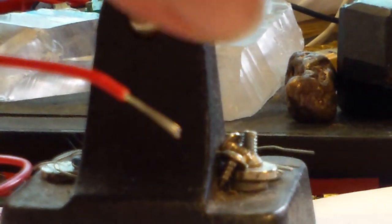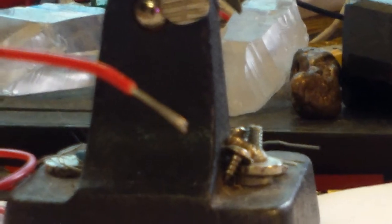Now to tin the wire — I've got to turn on the soldering iron. Okay, tinning — t-i-n-n-i-n-g. You see I've got a blob of solder already on my soldering iron, and I'm feeding that blob. I want to take that blob, touch it to the exposed wire, and it heats it up. Then you take your regular solder and touch it to the wire.